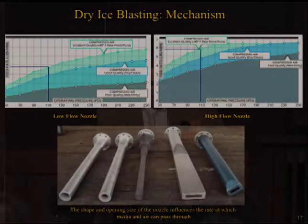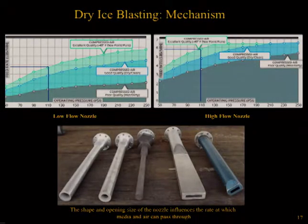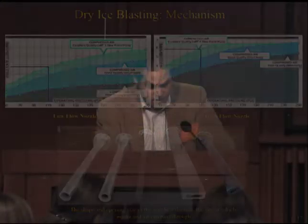There's also the number of particles in the system, denoted by feed rate in pounds per minute, which is tied to the airflow expressed in cubic feet per minute. The greater the volume of air going through the system, the more blasting media that can be accelerated at a given velocity, resulting in a stronger cleaning effect. For example, at an operating pressure of 110 psi, using a high-flow nozzle with a larger aperture, almost a third more dry ice media can be accelerated than with a low-flow nozzle with a smaller aperture. Other conditions that affect flow are diameter of the hoses, design of the blast machine, and performance of the air compressor system.